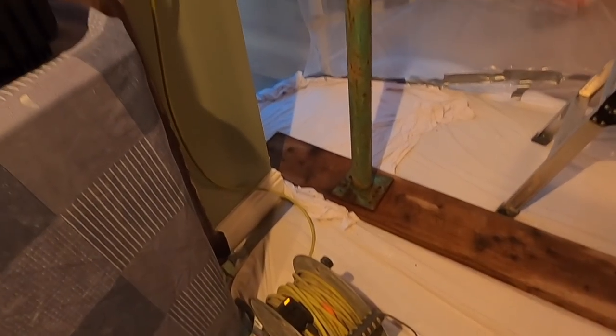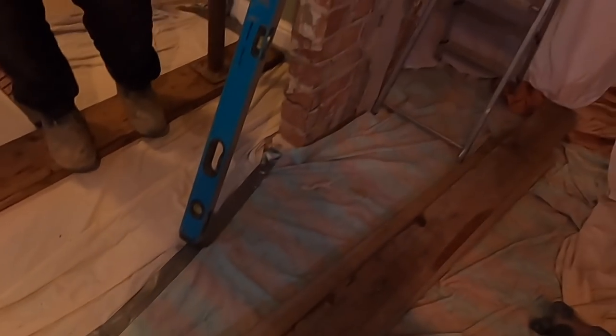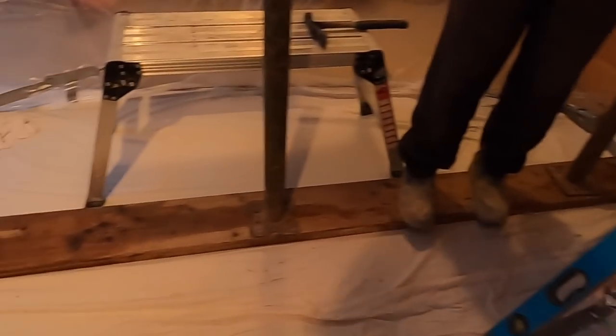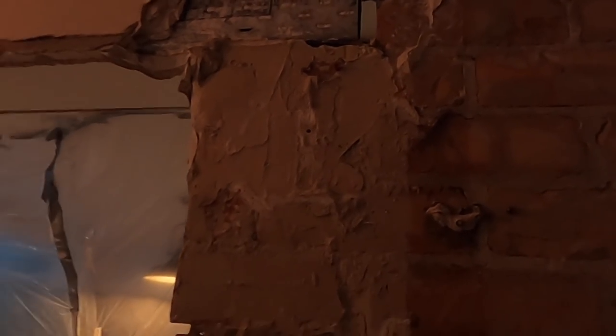Now what we've got to do now is go and pick our steel up, bring the steel in, put it in place, and then get the next ACROWS in, otherwise we won't get the steel in after. Then once we're all propped up, we can get this thing out, which shouldn't be much. It's just propped up, it's just dry bedded, I think, on a bit of slate. And then I think we're taking 450 off this. About 450 off it. And then we'll take out the pad stones at each end. Obviously, I've got the pad stones in. And then get the steel in.